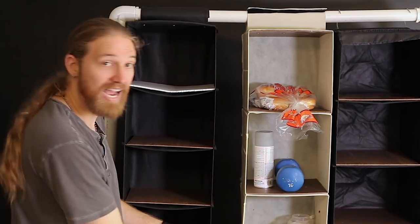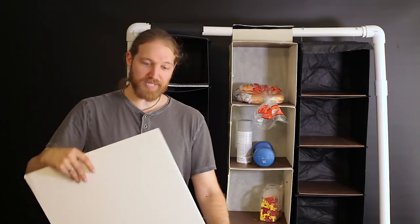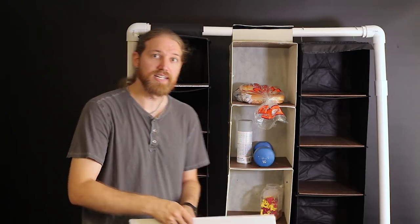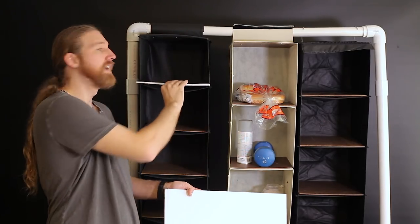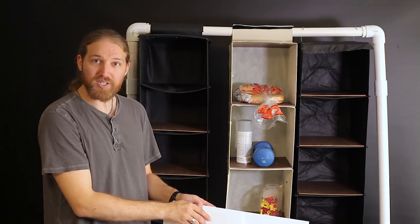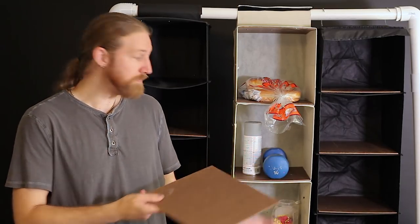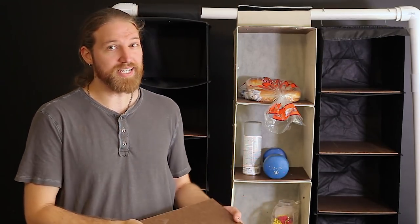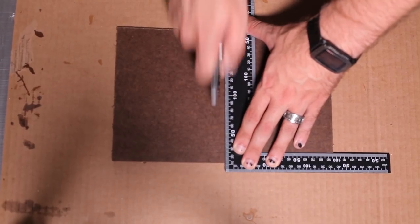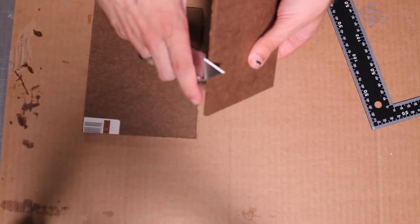Whereas our hardboard holds it like a champ. And again, an additional 10 pounds and that Super 90 adhesive isn't even budging. Another option might be corrugated plastic — it's really lightweight, easy to work with, and pretty inexpensive. If you cut two sheets, glue them together, and rotate them so that the corrugations go across each other, that would make a really stable surface that could hold quite a bit of weight. I went with the hardboard — it's pretty cheap, really strong, super easy to cut with power tools, though you can cut it with a hand tool or even score it on both sides with a utility knife and break it for a moderately decent cut.